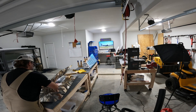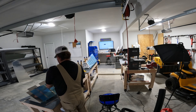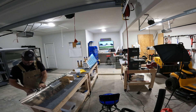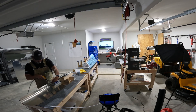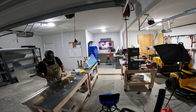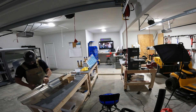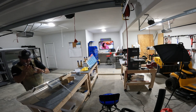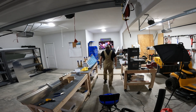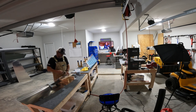Shortly after this we do the match drilling. This kit is pre-punched, meaning all or most of the holes are where they need to be with respect to the ribs and skins, but even where they're pre-punched they are not final-sized — they're just ever so slightly undersized — so you still need to go through and final-size drill them. I don't even use a fluted drill bit but rather a reamer, which gives a cleaner hole. Van's leaves you with significant work to do because it's your responsibility to build at least 51% of the airplane to qualify as the builder in the experimental category.